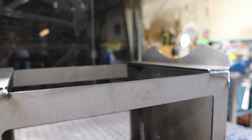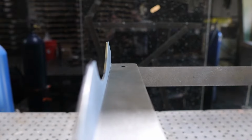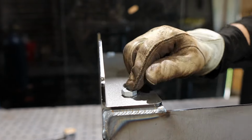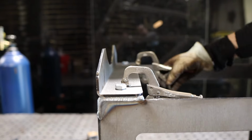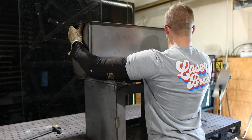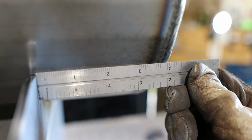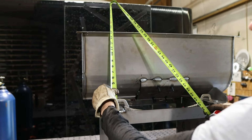Now you're going to attach the tub legs to the tub body. I like to use the base as an alignment jig for this using some half inch bolts and clamps. Place the tumbler tub onto the tub legs and align it as specified in the weld-out drawings. Make note that the tumbler sits at an angle because the mounting bushings are not even.